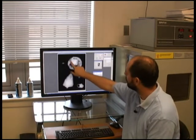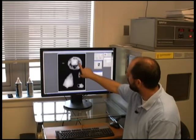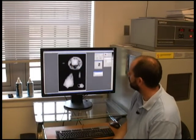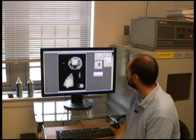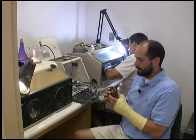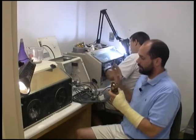It doesn't appear that there's a key stuck in the ball lock, and I'm learning a little about the construction of this other artifact — it's got a couple of things that have been brazed onto it and I'm not sure exactly what's going on, but we'll figure that out shortly. After the digital x-ray, we know which process the artifact is going to go through, and that's air abrasion.